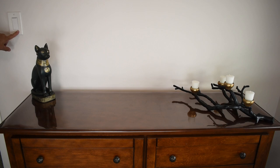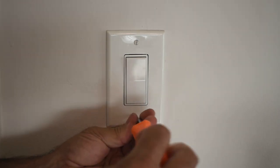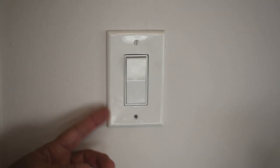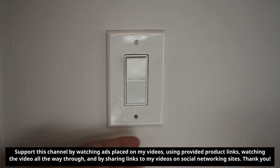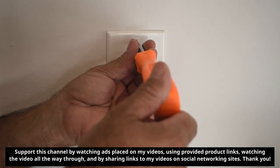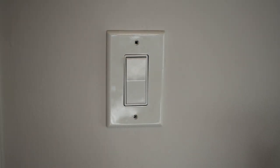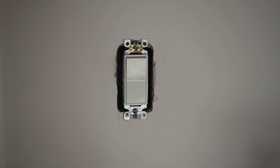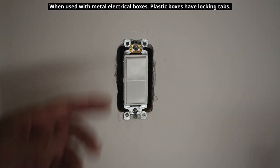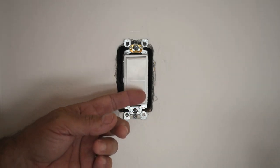To get started let's take a look at the wall switch. I need to find out if the power is coming in by the wall switch or by the receptacle. This house was built in the late 1950s and there's electrical metallic tubing or conduit connecting each one of the switches to the receptacles throughout the home. More modern homes will more than likely just have a Romex cable in the wall with staples, secured into the electrical box using a Romex clamp. With that cover removed, I'm going to leave something plugged into the electrical receptacle and then turn off the circuit breaker for this branch circuit.